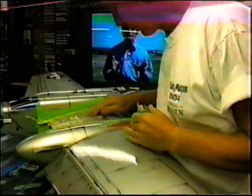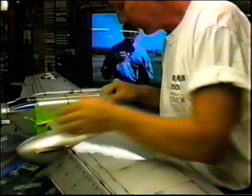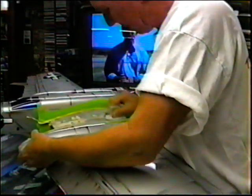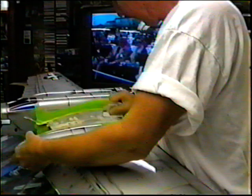Today it's always nice to take a little test of when you're going to sand any resin, especially West resin. Just take a little test from in the area, and I left the back masking on there. But once you see the powder coming up, you know it's going to be perfectly all right to sand this down.